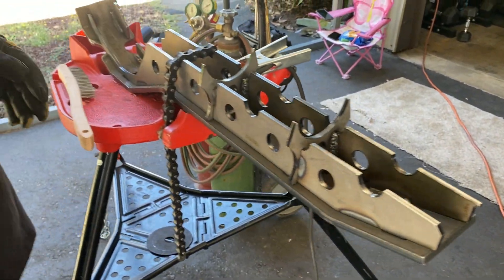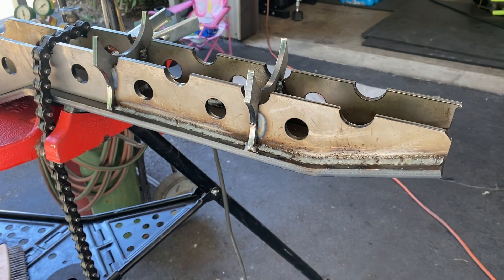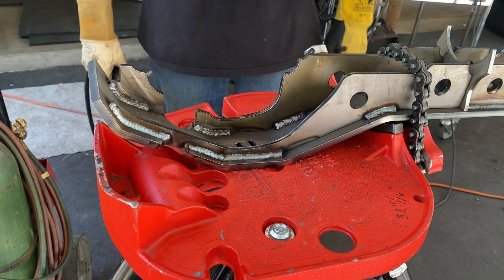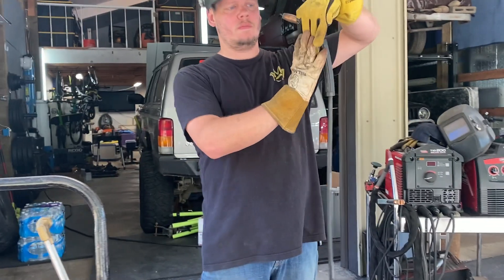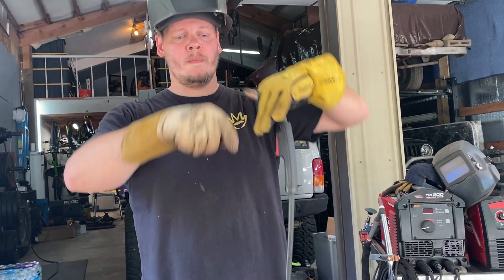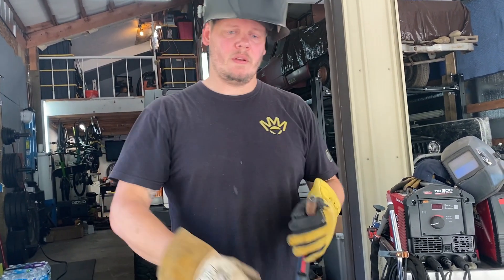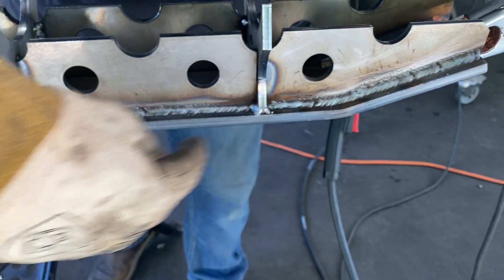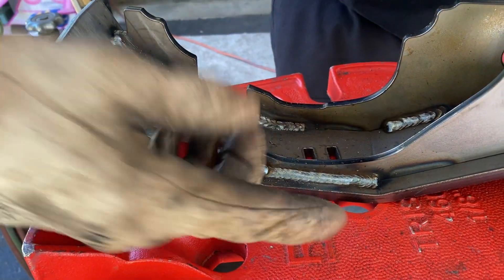I weld across the top and then on top of that, and weld up these on both ends. I tried a couple of different things and didn't feel right. I typically weld — when you have two pieces of metal stacked — build, pull, build, pull, and drag. When you get two pieces here I typically do a C-motion, but all my C-motions feel like they're looking off, which is still decent. Then I go back to my pull and drag and it looks way better.